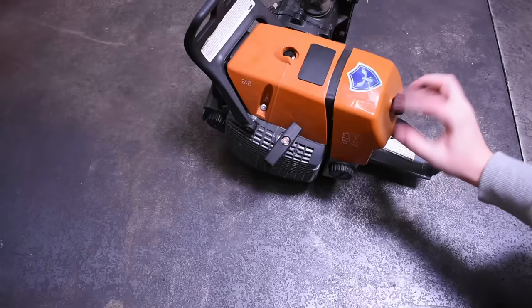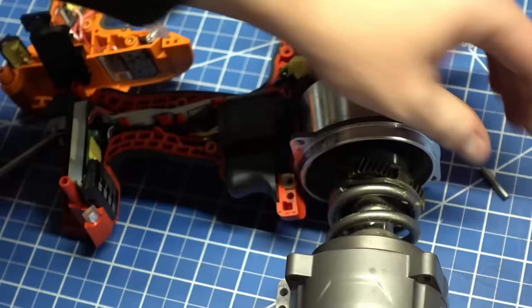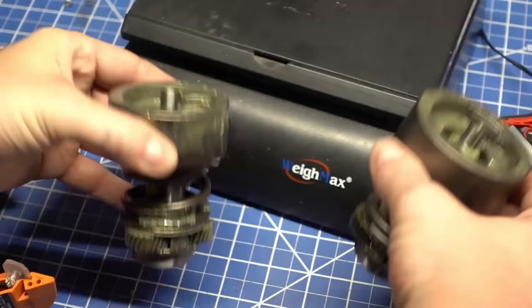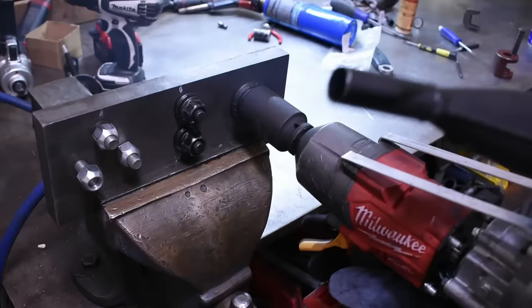Now, I know what you're saying though, 7 horsepower, how does that beat a boosted LS? When it comes to souping up an impact with a fixed hammer and spring size you don't get to design to fit the motor, something we have a bit of experience in now, it may be counterintuitive, but the way to increase impact wrench torque is to increase speed.